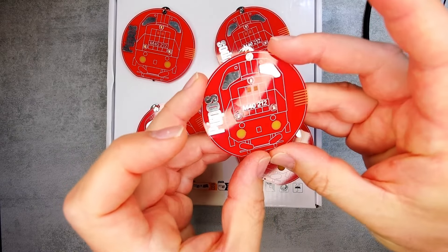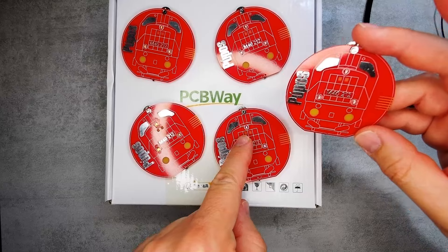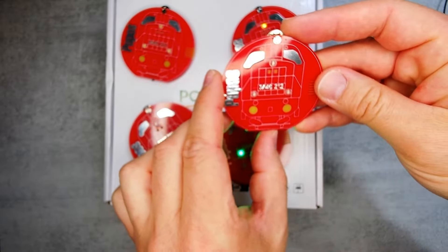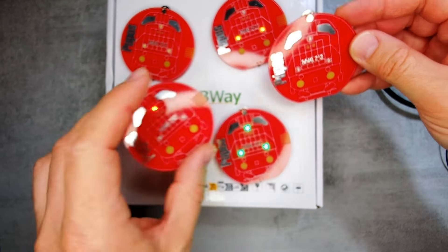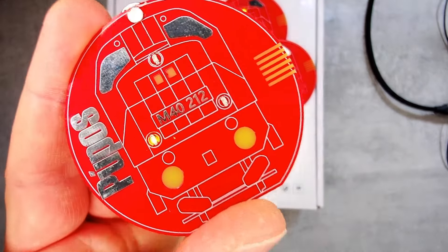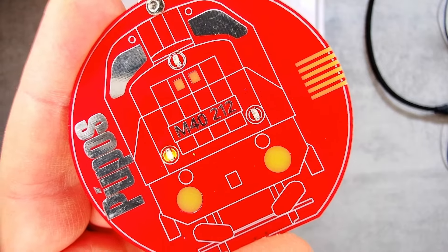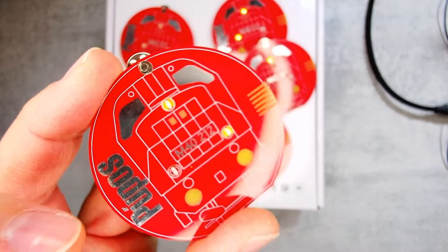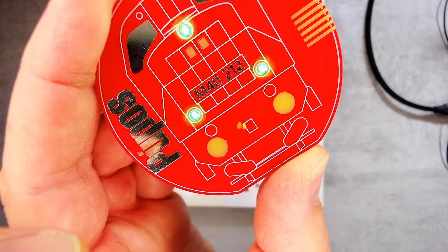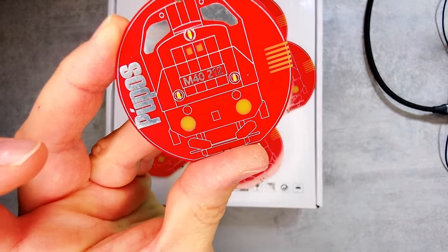I made a few of them with different LEDs, and none have series resistors so I might be over-driving some. For example, this green is really bright; this one is orange — not too bad. I bought these blinking LEDs ages ago and they didn't come with a good spec sheet. The forward voltage is around 3.2V for some and 2.7V for others, so I'm definitely over-driving the green ones. But since they're blinking they should survive. I also made one warm white.